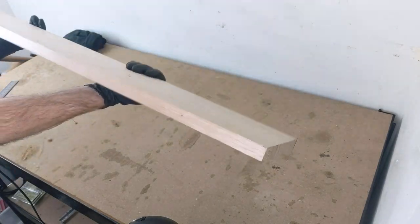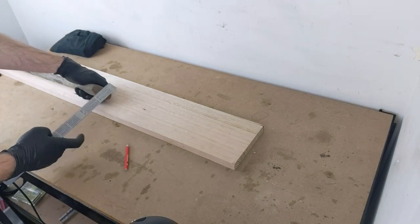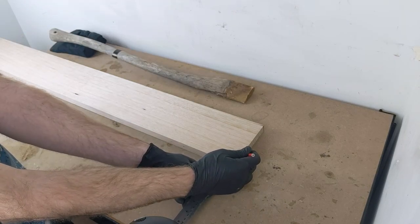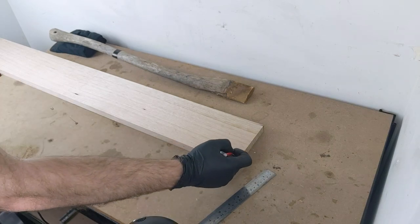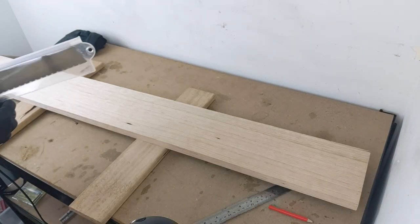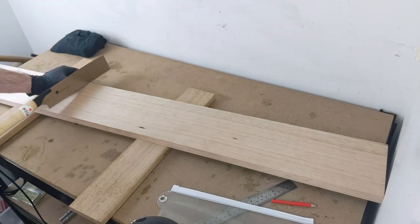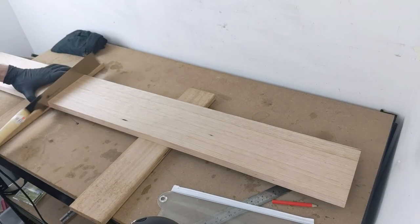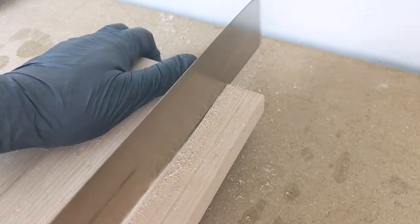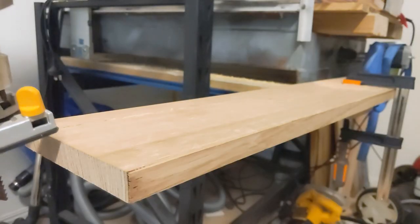I've decided to remake the handle as I just couldn't find one in the store that was good enough quality. I was wanting some spotted gum but ended up with this nice straight-grained eucalyptus that they've referred to as Australian oak. Not sure it'll be tough enough for this application but I'll soon find out. The grain orientation is a little off so I'm cutting it into strips and laminating it back together. This shouldn't affect the overall strength — if anything it could make it stronger. As much as I like using this saw, it's the wrong type for rip cuts so I found my old jigsaw to finish up.